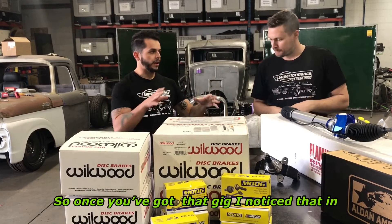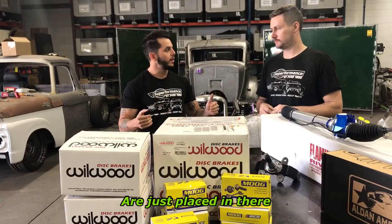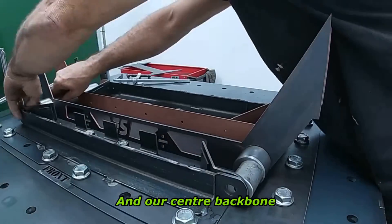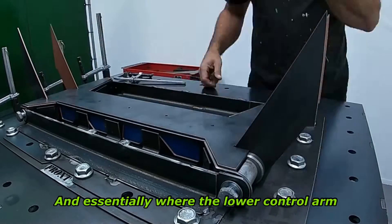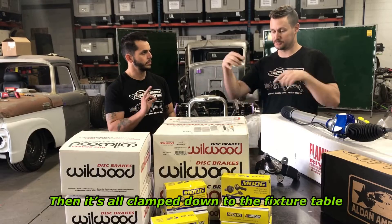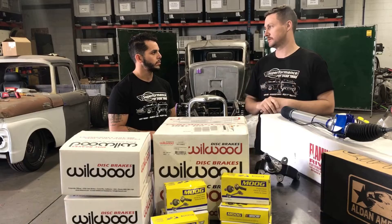Once you've got that jig, in the special rooms set up in the shop, you set up your jig and all the bits that have been cut out by the plasma cutter are placed in there and they begin to get welded together. Basically, we've got our fixture table — on top of the table we've got a fixture plate, which essentially holds all of our plates that are cut out, our centre backbone, and our machined and threaded ends. The fixture plate bolts to the table, and then where the lower control arm is bolted into the cross member, we use those points as fixture points. Using machine spacers, it's all clamped back down to the fixture table before you weld it — weld one, throw another straight in, weld it. Pretty much aimed for speed, mass production, and quality every time.